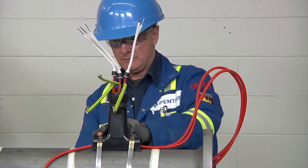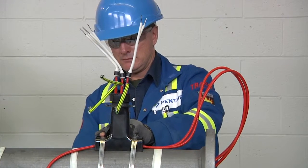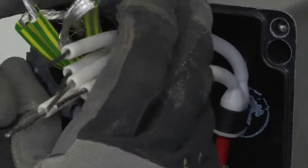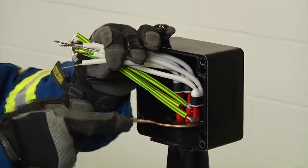This prevents the cable from being crushed by the stand. Be careful not to run the pipe strap over the heating cable to avoid cable damage. Now remove the lock nut, install the junction box, and reinstall the lock nut. Be sure to tighten the boxes completely onto the stand so that the grommets seal properly.